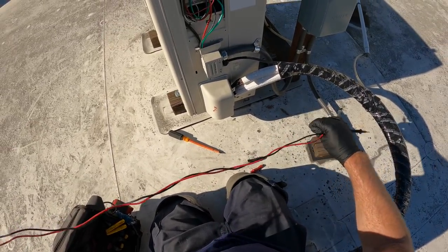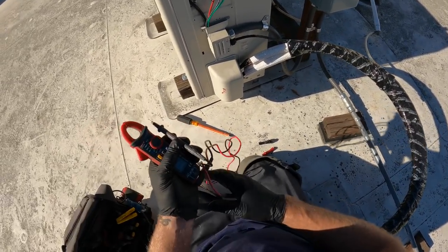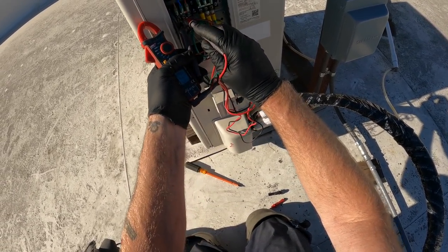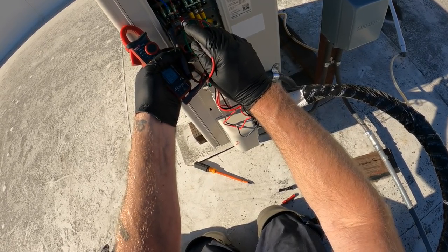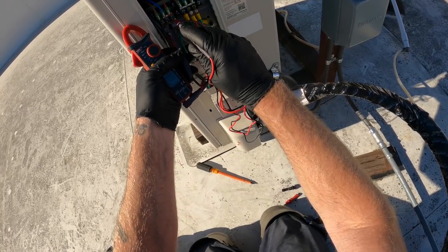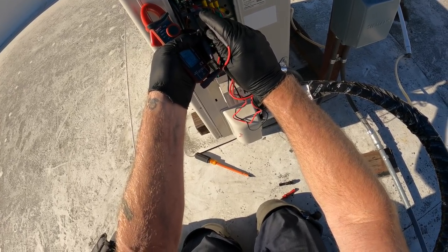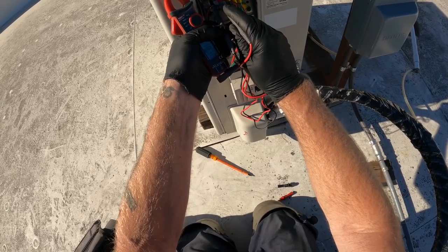And then my plan was to go ahead and button her up. I've got to take apart the downstairs unit and find that pump and the float switch, see if it has failed. That's what you want. You want the voltage dancing all over the place between S2 and S3. You don't want a steady voltage there when we're doing it. It's communicating, man. It's communicating.